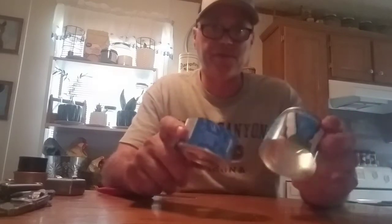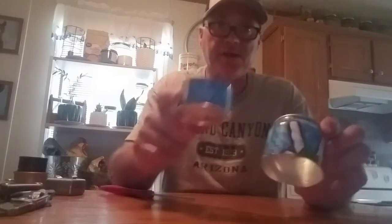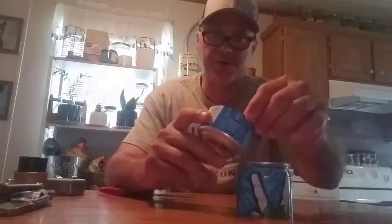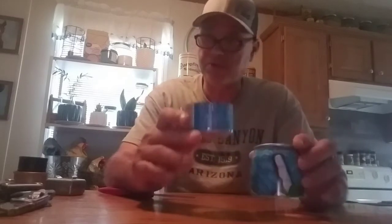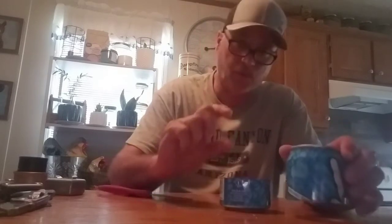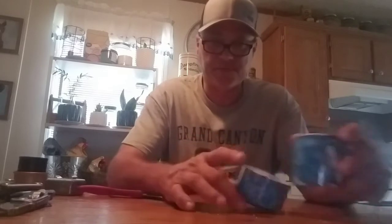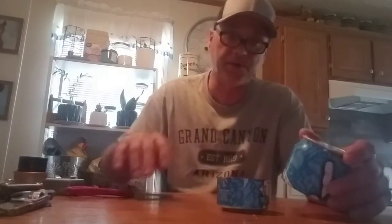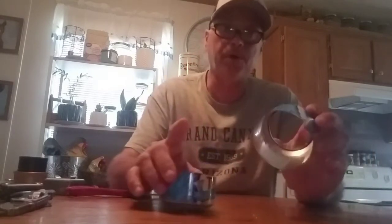Now the reason neither one of these are specific, but the one thing, and I forget where I saw this on a YouTube channel, is that the most efficient burn for alcohol is for it to be 1 inch above the flame. So when this is slid together, your pot will be 1 inch from the burning point of the gas. So that's the most efficient way. And now we have our 2 parts. Now we're going to put the flutes in the top piece.